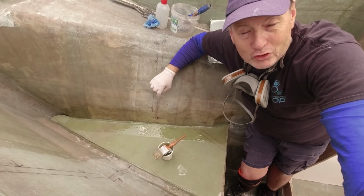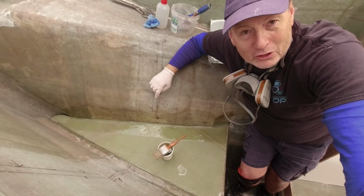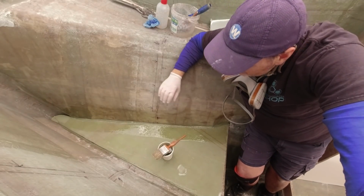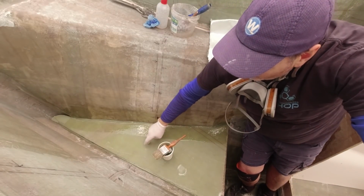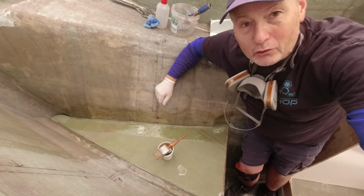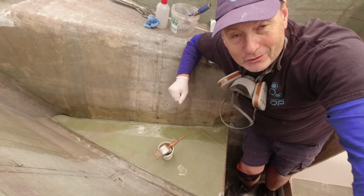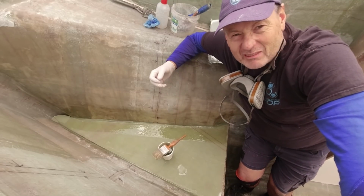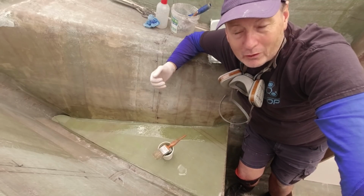But wherever I've had structural members, I've actually used vinyl ester, particularly in the main compression bulkhead, the sail bulkhead, and then the forward bulkhead as well. But in here, I've actually got a combination of two chemistries going on. I've got polyester on this foam sheet here, adhering to the foam. Underneath, I've glued epoxy and let that tack off, and then I put in a fillet of vinyl ester and cotton flock, which is actually like a glue thickener, which gives a little bit of structure, but it really does provide a solid base for a good fillet.